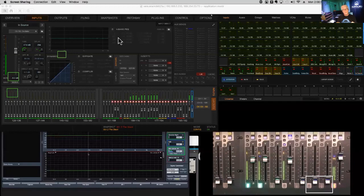Where this gets tricky is if you've already established a pathway and are trying to align a C6 channel to it — then you're not going to get a flat phase trace for the C6 alignment, you'll get that crossed-over trace. It's a challenge, but watch the impulse and get as close as you can. Maybe in that situation it would be interesting to do some pink noise cancellation to see if you can make it cancel all the way out.